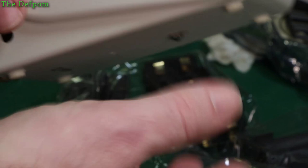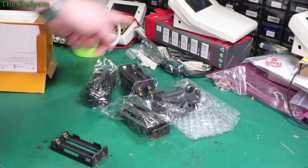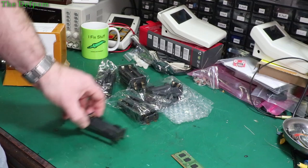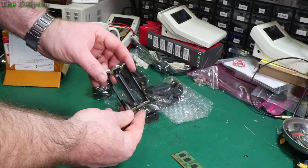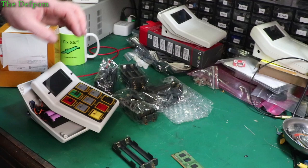Now that's the problem I've got with these ones - the mounting is actually directly underneath the battery in the middle, which isn't the best place. In this case they're okay because I've used countersunk screws, but on this other unit, the first one I built, that has a different bolt on it and it's actually protruding slightly - it's in the way. I'm just going to change that one to one of these. I think these will be better. How well they hold the battery though, I don't know whether they're going to be held in place securely enough. But they should at least give a good connection. This one I'm planning on taking the batteries out of.